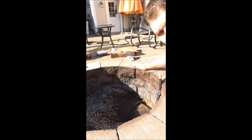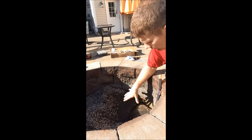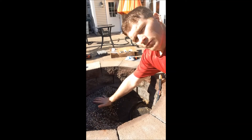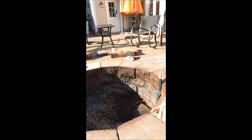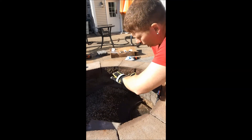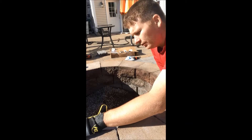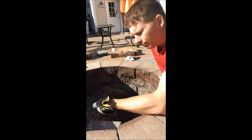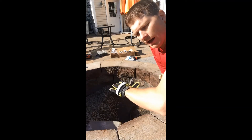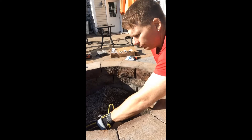I have all my stone back in place for my fire pit. As you can see inside, I previously had some sand and some pavers raising the fire pit up a little bit. Now I'm going to use pea gravel to level the bottom. Once it's level, I'll use some leftover pavers and raise it up — probably four of them in a circular fashion — to a few inches below the top of my fire pit, and then put my hardy backer board down. That backer board will be used to support both my burner and the glass stone I will have on top. I'm going to go ahead and level this out and then build it up with a few pavers.